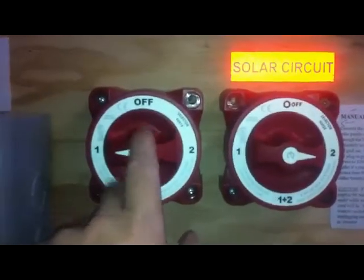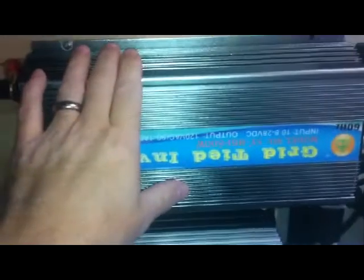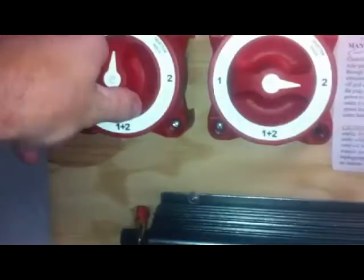So I'll show you here — this controls my wind, this controls my solar. My solar is right now just in grid-tie, and this is my small three-panel, 335-watt panel setup. It's very late in the day so these are only kicking 120 watts, these three panels. I have an Enphase system that does all my big panels. The wind is in position one; I can go to position two and put the wind right into this plug-in grid-tie, and you'll see the watts register when it starts blowing.